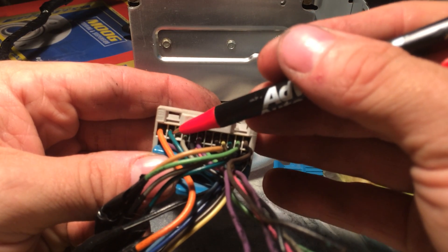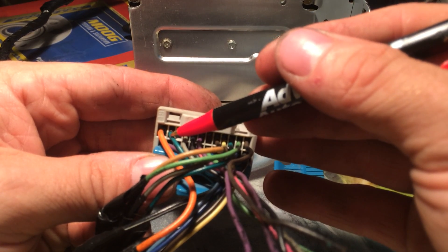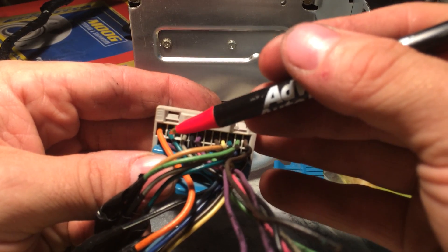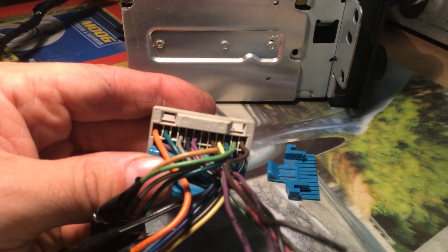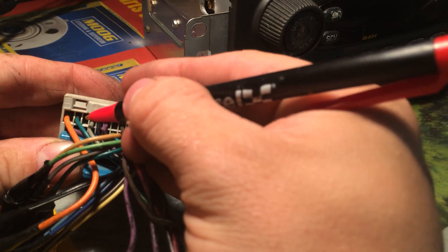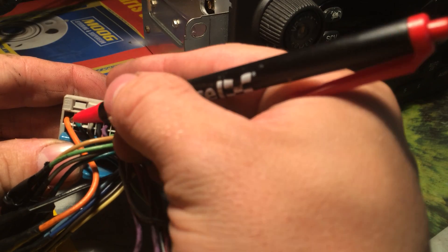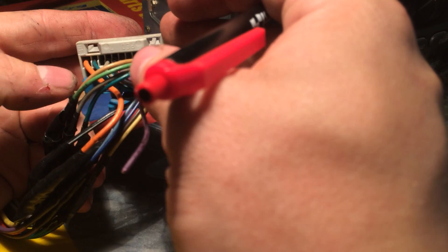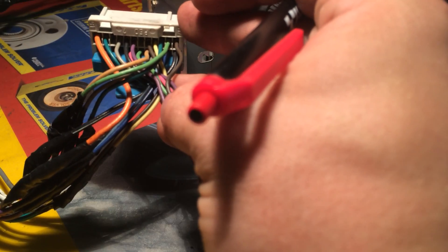And this is what you also need to move - this wire here to this side of the harness. If you follow my other video on how to remove the chips from these radios to unlock them, if you want to use them on a bench or in a garage like I do, you have to move this wire from here to here, and then just to use it on a bench, you tie the two together and put 12 volt positive into that.